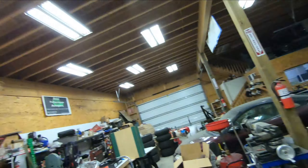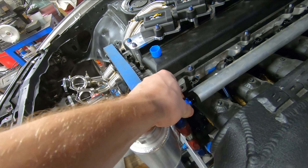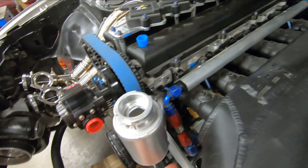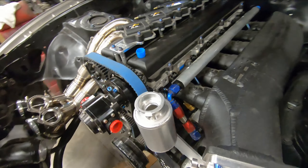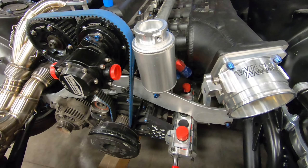I got the tube and the flange welded to the fill pot body and it's installed on the car. The fitting has plenty of clearance to the tube and can still move around. There's also plenty of clearance to the timing belt and everything else — obviously the throttle cam is very far away. Now the last thing to do is to put the tube stub with the actual 16AN male weld-on fitting onto the fill pot body, which means repeating the same coping process to fit the outside radius of the fill pot body.